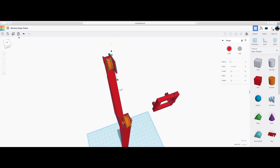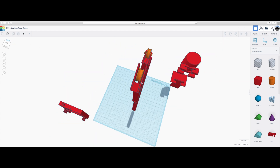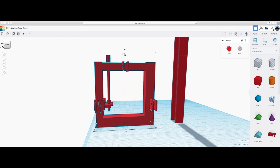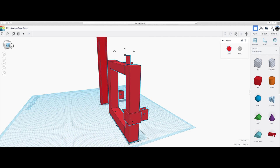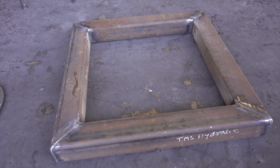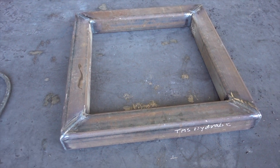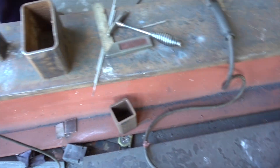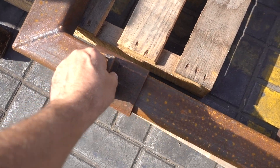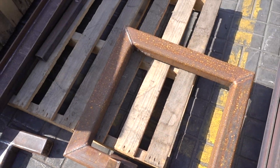In the end we're going to have a working post driver. I'll use a ballast of about 30 kg with a lever of about one meter. The I-beam is 2.6 meters high. On the left side you can see an adjustable screw — when that screw is moved, the left side will move up and down, meaning the three-point linkage can move about 15 to 20 degrees. This is what we need when we're in a field that's not level — we need to move the box iron up and down to change the angle on the tractor.